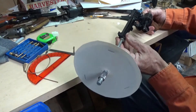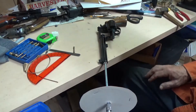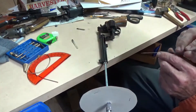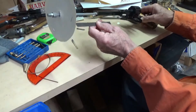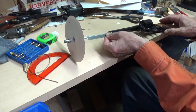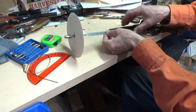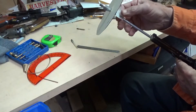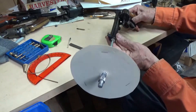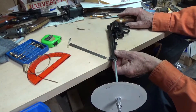We're going to bring that back out so we've got as much distance as we can get on it. Next, we're going to measure. This is a 6-inch barrel, so I think if I use 4 inches of movement, that's what I want. What we're going to do is measure 4 inches up from the barrel end, and that's where our tape comes in. We've got our tape at the 4-inch mark. When we ram our cleaning rod in here, we're going to end up with a movement of 4 inches in the barrel, and we're going to see what kind of amount of turn we've got.